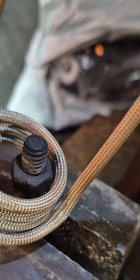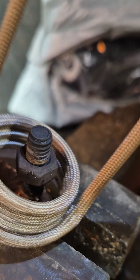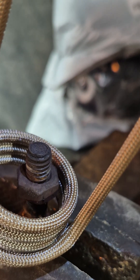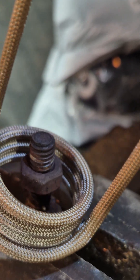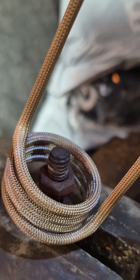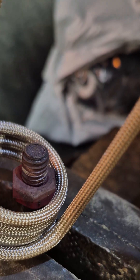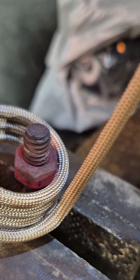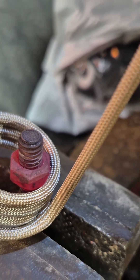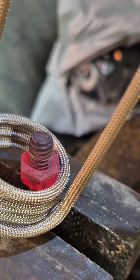It's a thick bolt — this is good American steel right here. It's just starting to heat up now, getting to cherry red. Notice the nut is getting red and the bolt isn't — that's what you want. You want to heat up the nut; the nut will expand and it will loosen up and you'll get it out of there.